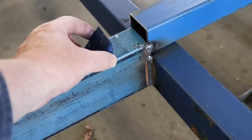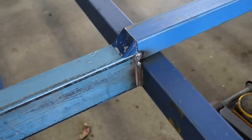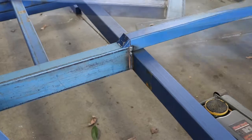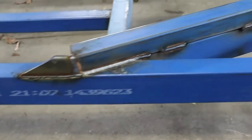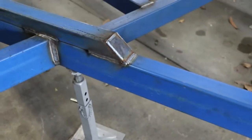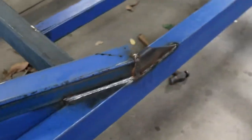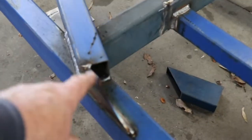And then that bit goes just in there. I'll weld that in. So that's the drawbar welded in. That's some gusset in there. That's actually a lower gusset I put under the drawbars. Put a 45 degree taper on it and block the end in. So there's the other side. There's the other little gusset there. And that section there goes right through and connects the drawbar solidly into the main chassis rail.